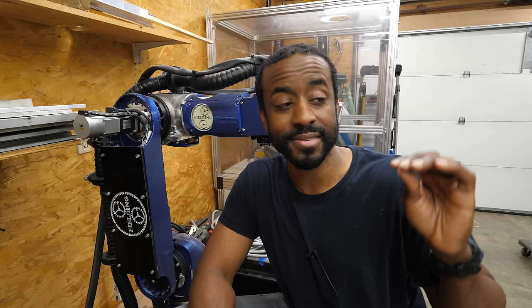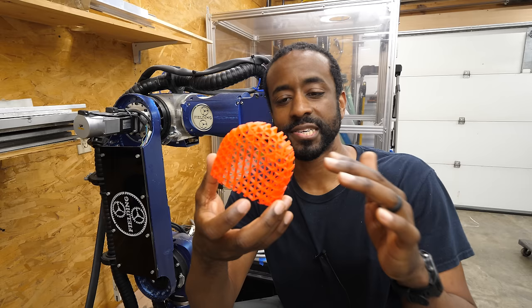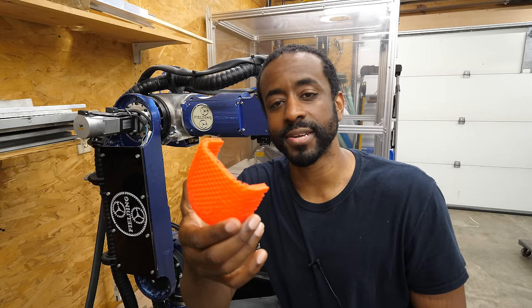I want to apply that here with my carbon fiber. What I'm going to do is design an infill pattern — I printed an example right here. This is an infill pattern printed by reducing the number of exterior perimeters to zero. Here's another one with the hexagon pattern. You can buy honeycomb sheets of all different materials, like aluminum sheets of honeycomb. The idea is to 3D print some kind of mold as an infill pattern that I can build up the carbon fiber around the outside of. The plastic stays inside, it's very lightweight, and the carbon fiber takes up most of the load.